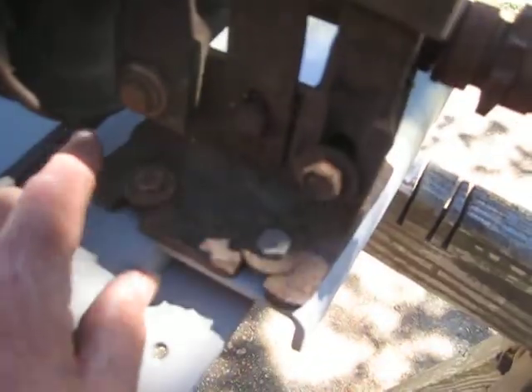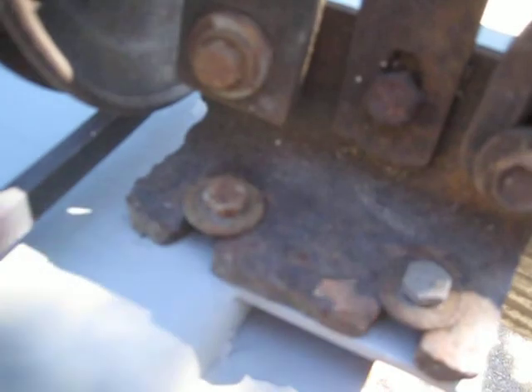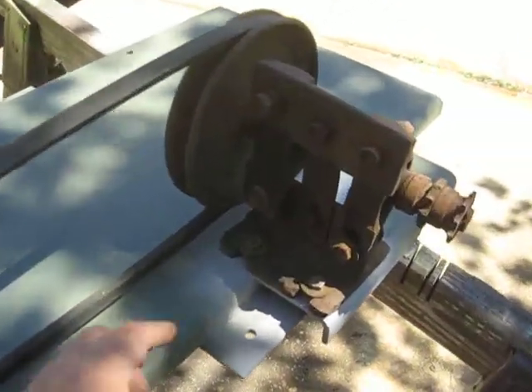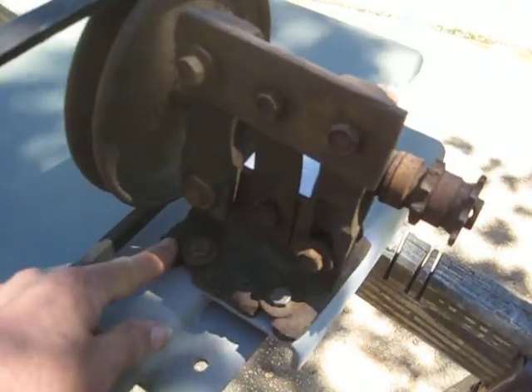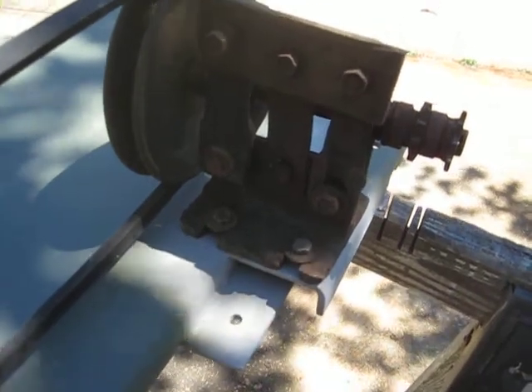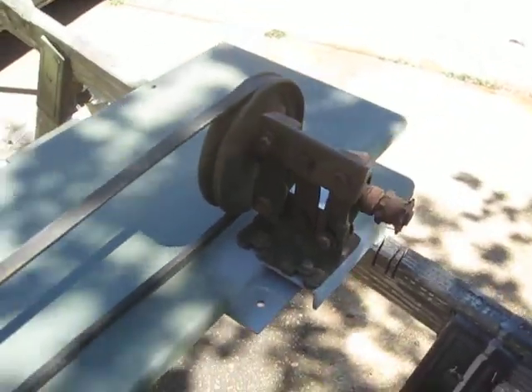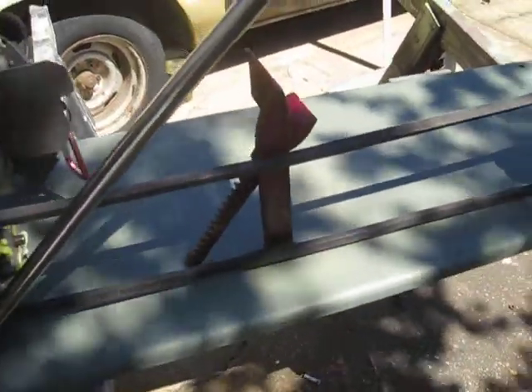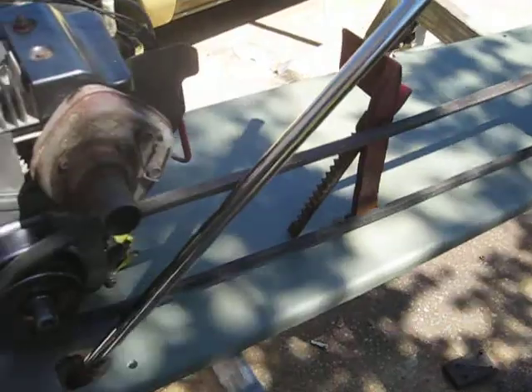This bracket — can't see it in the video there, but you can maybe tell — it's kind of pitted. I don't know if I'll be using it or if I'm going to fabricate another one of those. But everything else is still good. The pull is good, everything is sandblasted and it'll look good. I may be able to grind this some and weld it back up. It's not cast — just mild steel someone made in the past. I'll probably just make another one and be done with it, where it'll look a lot better than having to wrestle with all that rough stuff.